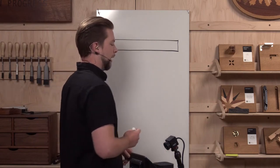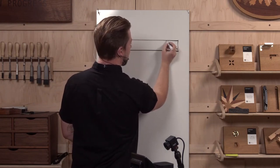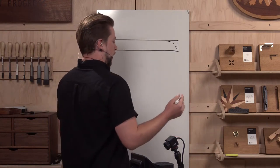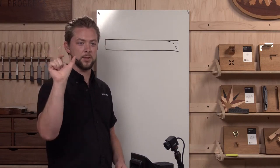But let's talk about how we're getting all those details, especially that kind of top rounded detail. It's like a full round. It looks very similar to that. All this is going to be done using on-tool CAD, making rectangles and rounded rectangles and placing them in a specific location, which just got significantly easier with position. So now instead of dragging the tool, you just tell it exactly where you want this rectangle to be on your XY grid, and it will snap directly to that. Okay, so our slat pieces are 2 inches by 17 long. So my rectangle that I'm making is 3/4 inch tall by 2 inches.